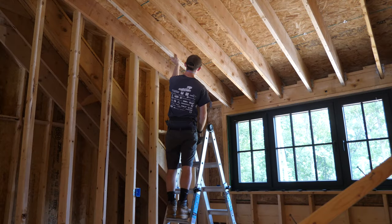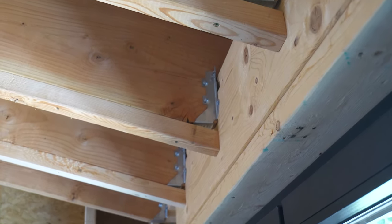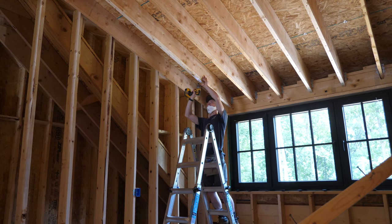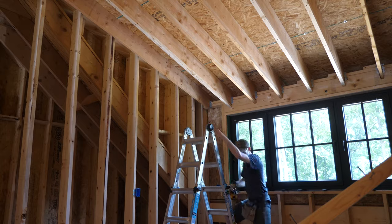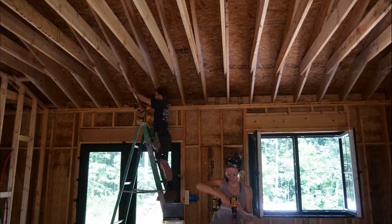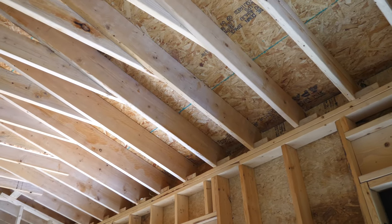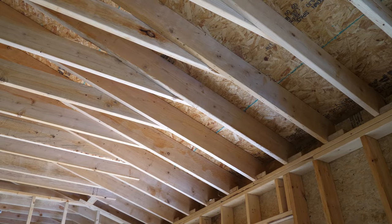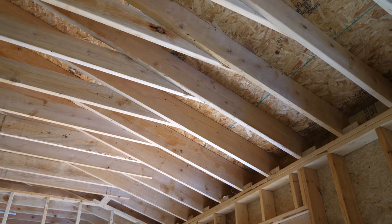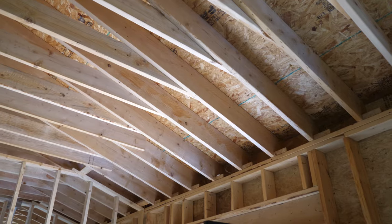The next project was to add furring strips to the bottom edge of the rafters in the dormers to accommodate more insulation. These ceilings are permitted to have slightly less insulation than the flat ceiling because they are cathedral style and limited to a small area relative to the main ceiling. Furring them down with an inch-and-a-half strip allows us to use a full batt of R38 rock wool and still maintain a one-and-a-quarter inch airspace above for ventilation. The same will apply for just this little bit of sloped ceiling where we meet the back wall.